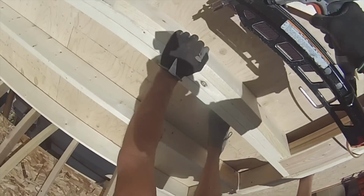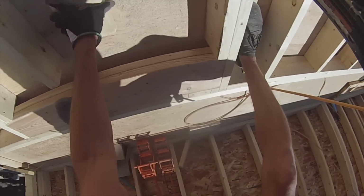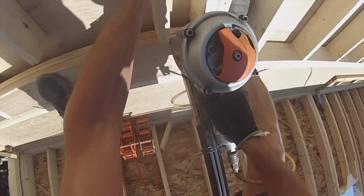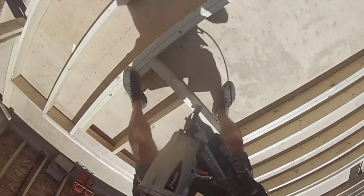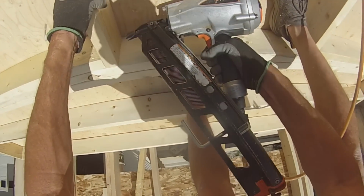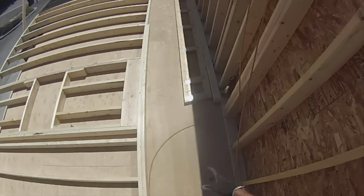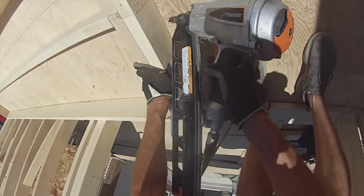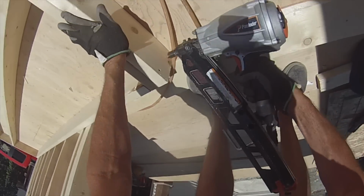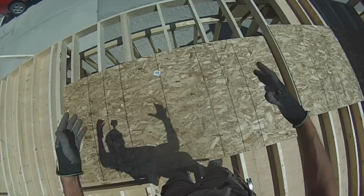Okay, top trimmers. Okay, that's the top sills. Bottom sills. Okay. All the windows are in. So I'll just cut the 2 remaining pieces of cap plate and I'll install those and then we'll square it. Okay, this is the cap plate. So it's framed. Okay, so I snapped that line again on the bottom. So now we're going to sheet there and up.